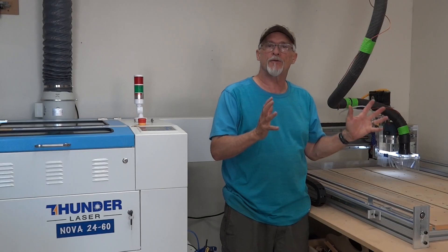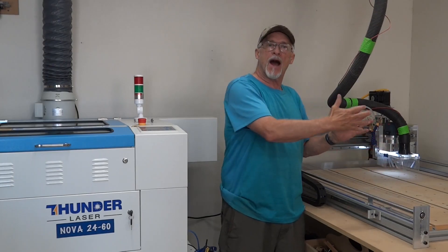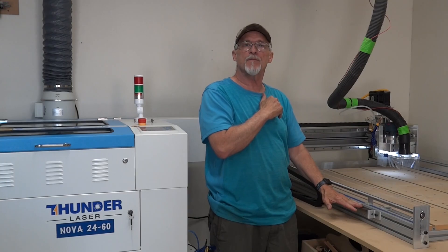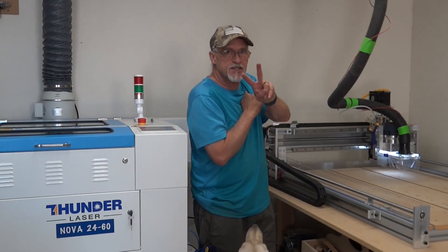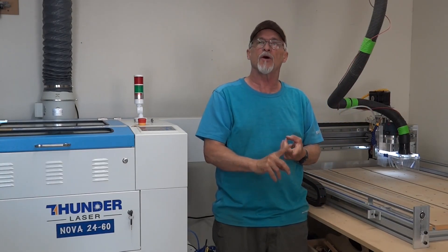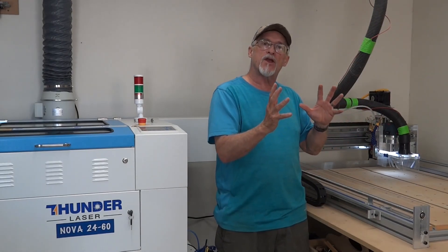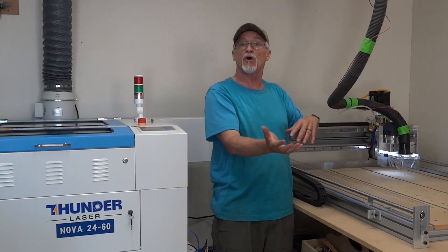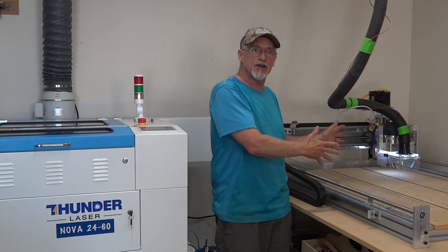So let's do a quick review before we move on to the CO2 laser. If you're looking at a CNC machine: buy as big a bed space as you possibly can; go with high-end quality materials; make sure you get all four of your limit switches; get good quality control software like Mach 3 and VCarve Pro. If you can buy it as a kit, definitely do that — down the road when you've got to replace or maintain this machine, you'll know how to do it.